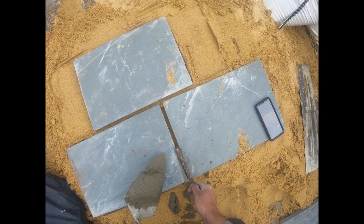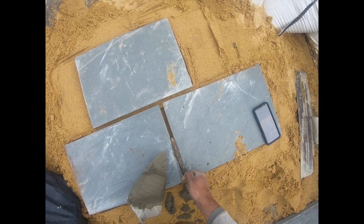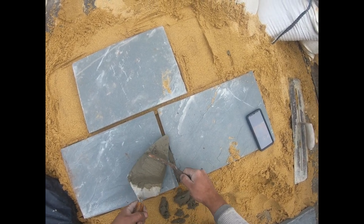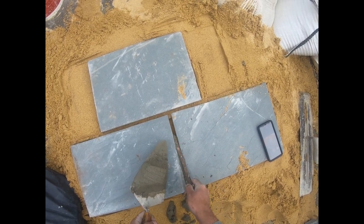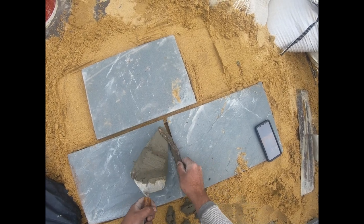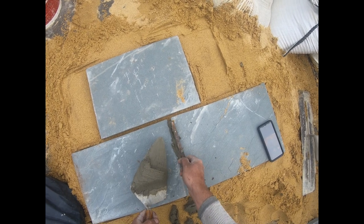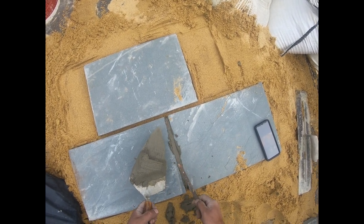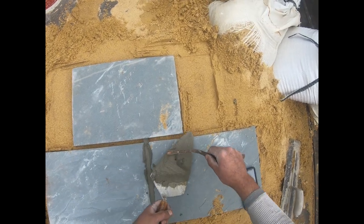You know, if you see somebody come out with the pastry bag, your patio's in jeopardy. You need lime to make it come out of the bag. There's not supposed to be lime on your patio, right? Also, it comes out of the bag too wet. It's already weak right there. It's just too wet. You've got to make it like soup to make it come out of the bag.